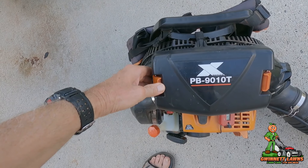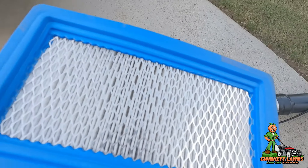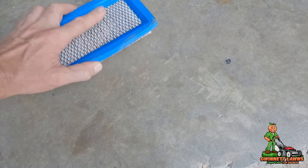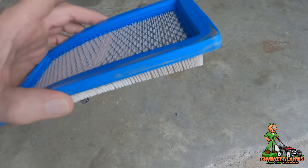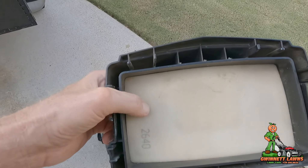Hopefully that helps. Go check your mowers and do the same thing to your filters on your blowers and weed eaters. They're not operating in as dusty an environment as the mower, but the blower would be the next one to watch. Let's look at this blower — it has about 120-something hours on it. See that pre-filter? Look how clean that is on the clean side. These paper filters are really good at filtering out contaminants. Alright guys, go do your maintenance, make this equipment last — it's expensive. I'll talk to you on the next video.